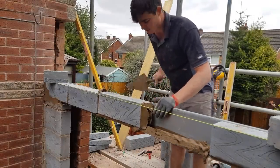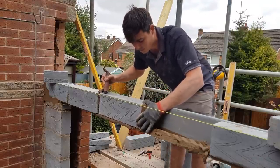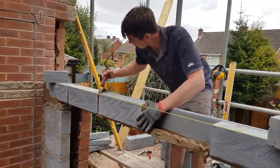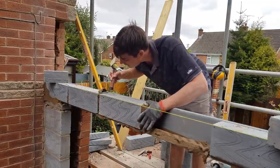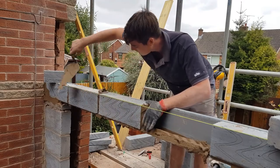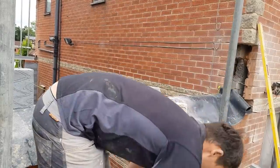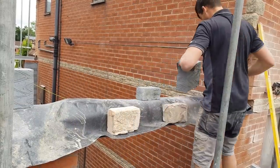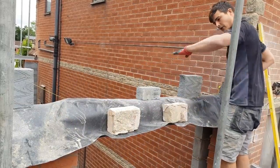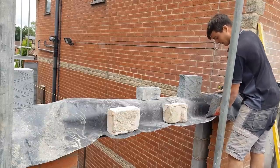Also when laying over a lintel, don't whack it down. Because if you start whacking stuff it's going to move. I used to do it — my old self, you'd see it go mad. So I'm not building on top of this today, but because I'm building on the back I like to put a bit of counter-weight on the front so it doesn't start cracking back at all. Just a little bit of weight will hold it.